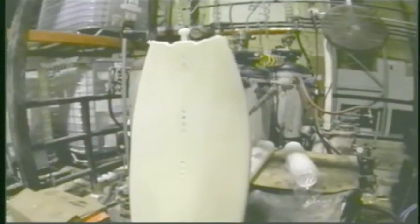Inserts all located, ready to go through the sandblasting process. You can see the cores here — this is exactly just out of the core mold. Resin won't adhere to this, so we have to create a rougher surface so we can bond our resins and fiberglass to it.